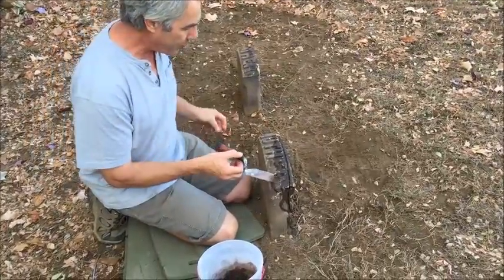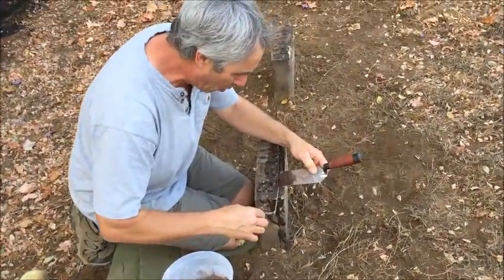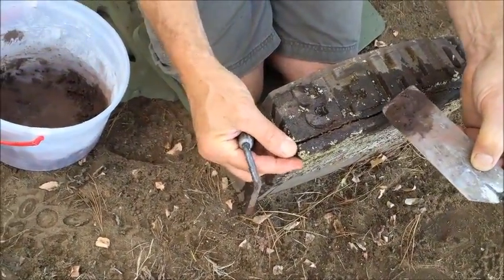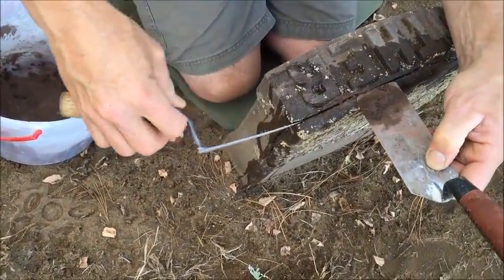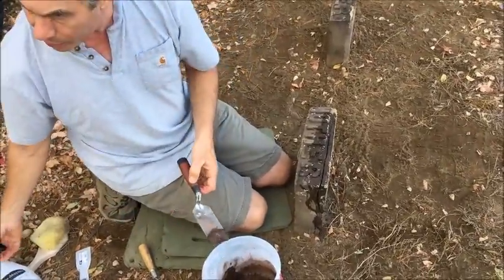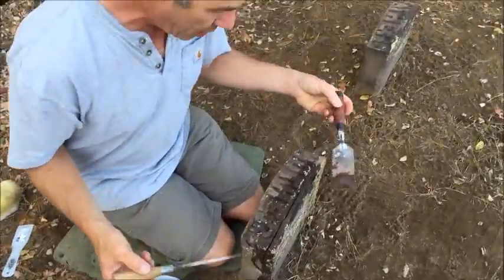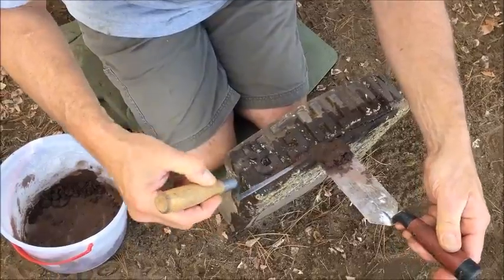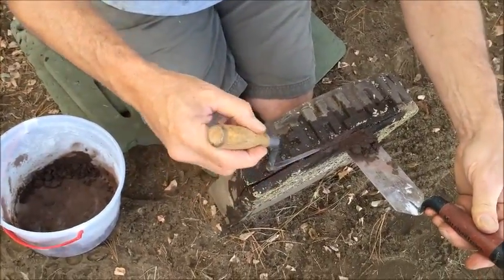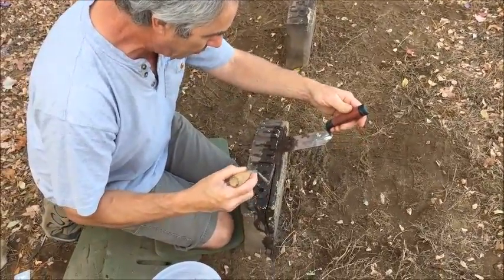I have some pre-mixed mortar already made up here. We'll cover that process in a future video. We're going to work this mortar in to the crack here. Sometimes this can take a long time — you can see that this piece of stone moves a tiny bit because it's so detached, so we're going to have to work a lot of this in. It takes patience; we don't want to be overly aggressive. This mortar is a little dry, but in this situation we can just dampen it down a little. I'd rather have a slightly wetter mix here than for traditional pointing work, because we're trying to work it in and have it act as a glue as well. You could also use something like an injection grout in a situation like this — that would probably get deeper in — however it can make a mess and it's more tricky to pigment. So this will be a good stabilization.